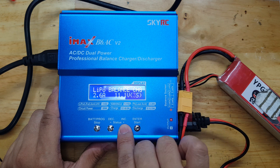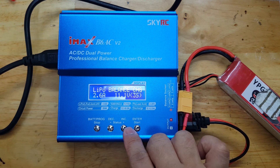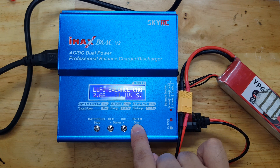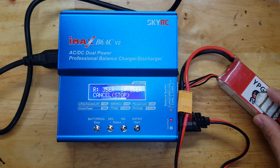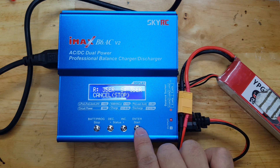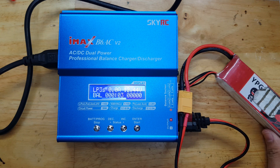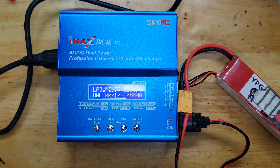So let's set the charging current — 2.6. For the configuration, 3s should be enough, but you can still change it. 3s is the one that we're going to use. Then you just have to hold the Enter button. It will check if it's really at 3s, and if there's no error, it was able to validate that this is actual 3s, so you could just confirm. Now it starts charging. Currently it's 12.45 volts, and this is the charging current.